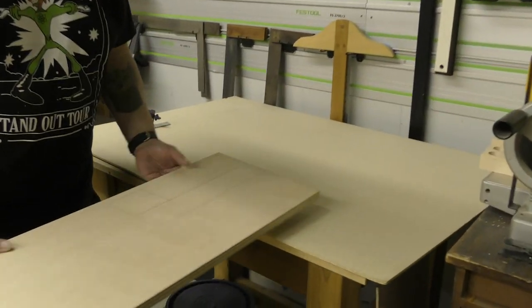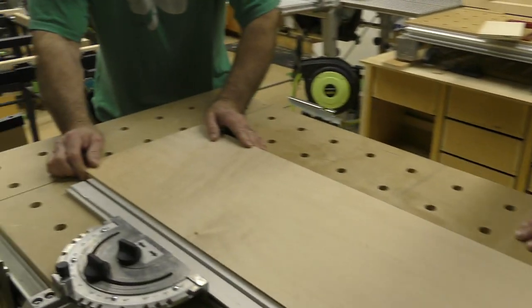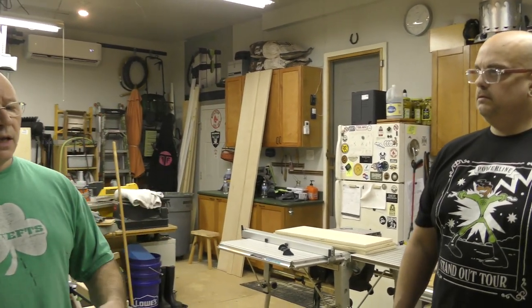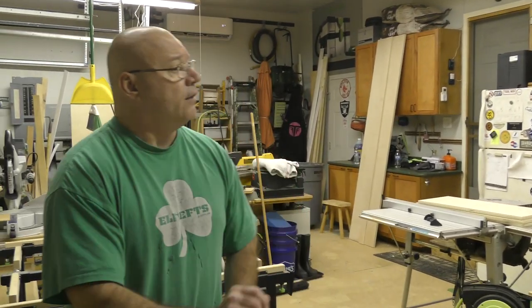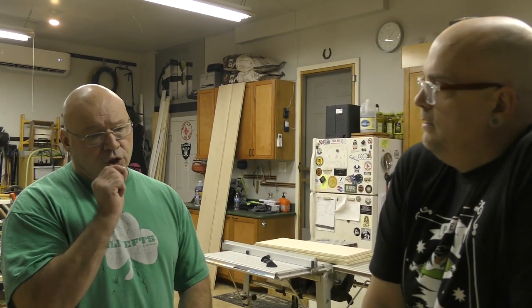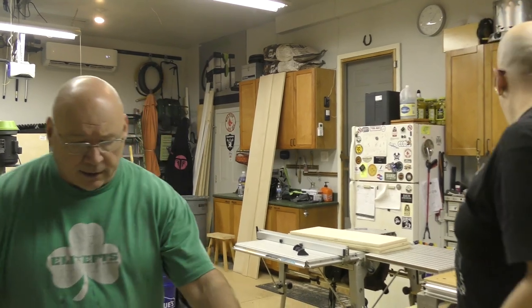And we get the circle table over there. And now we gotta get a 90 on this. This is so common. If you had done that and gotten a 732 cut on that, we don't know if that was 90 yet. You have to ensure it's 90. When we start joining that box together, that could twist the box out of square. Don't wanna do that. So let's get the 90 on here. We'll label it.